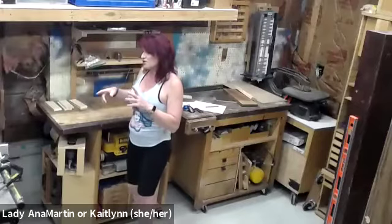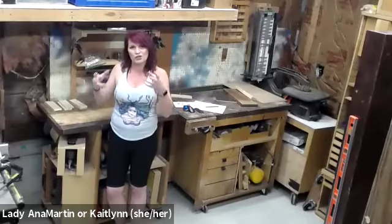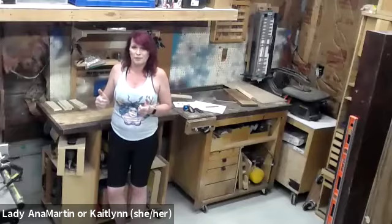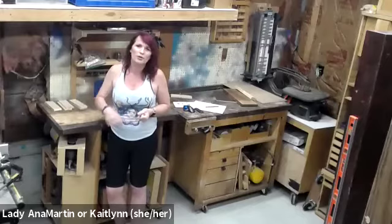So a torsion box gets rid of solid material by putting in an internal structure that's all glued and nailed or screwed down, and gives tremendous strength, tremendous stability, and very, very lightweight. It's kind of junky when you're closing a hollow core door. You really can't get angry and slam a hollow core door.